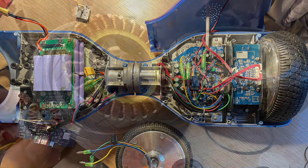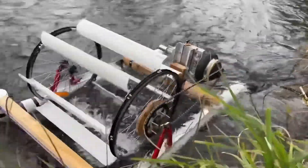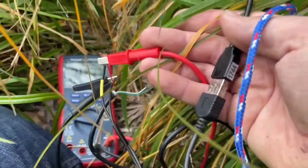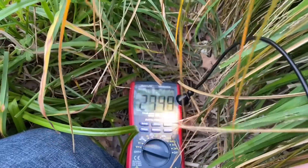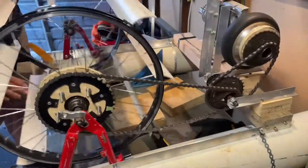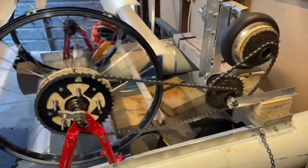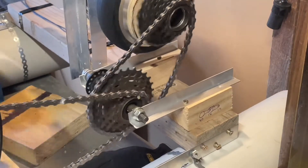I bought this hoverboard — it comes with a good stack of lithium batteries and a three-phase motor. Here's the configuration it's going to be in. I've got it all put together; this is my first version, slightly smaller, using cut PVC pipes — that took ages. Ended up not being that efficient, the light was just flashing on and off. In the end what I needed was a bigger three-phase rectifier with bigger capacitors and to spin it faster. So I designed this gearing system using three bicycle wheels and two chains. It gives about a one-to-five ratio, so the generator at the back spins five times faster than the water wheel turning it at the front.